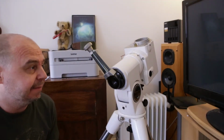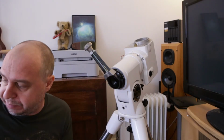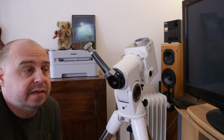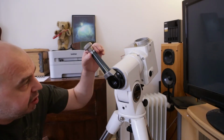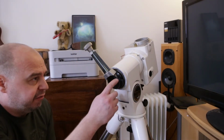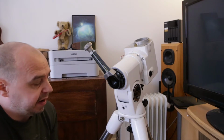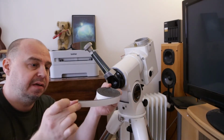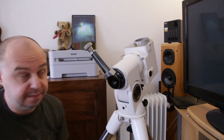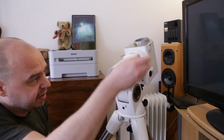Alright, new day, new tools. Turns out that my pliers, any of that I had, just were not big enough, so I went to the shop and was not able to find big enough water pump pliers, but instead I went to a car shop and bought this oil filter removal tool. But the diameter of the ring is 57 millimeters, and this tool actually goes only down to 60 millimeters. But what I did, I wrapped a little bit of a double-sided padded tape around the ring, and by tightening up the oil filter removal tool, I'm actually able to unscrew this or loosen it up.